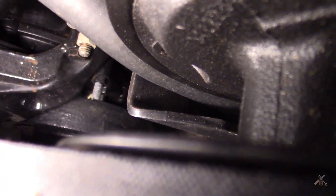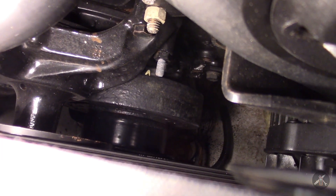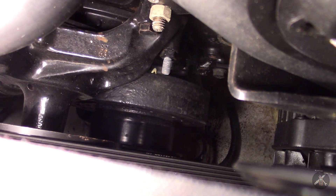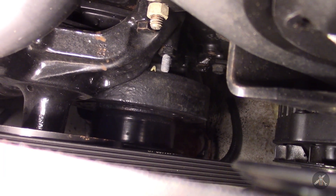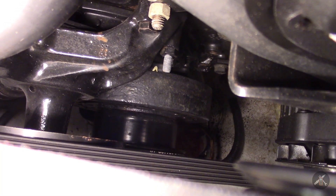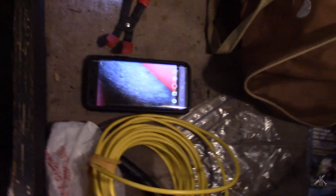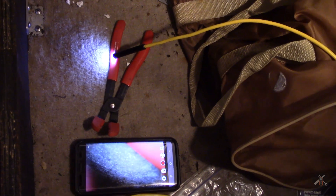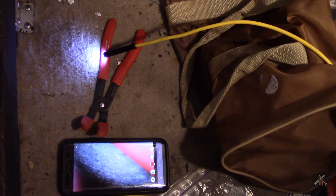There's a pointer down there — that white mark, the V-shape down in the center of the screen. I should be able to roll it until the timing mark comes up for number one on the compression stroke. It can be compression or exhaust, so you've got to make sure it's the right time around. Then I'll go around and roll number eight until it's up and follow through the firing order. I can look through the spark plug hole and make sure the valves are closed.